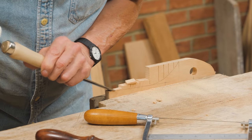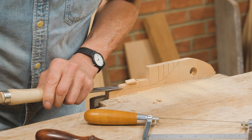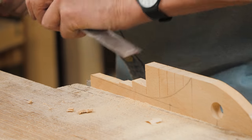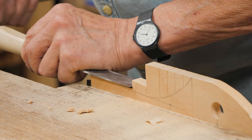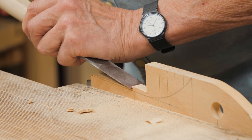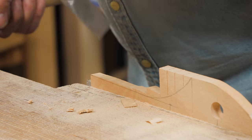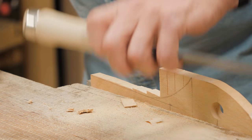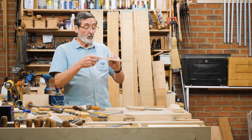And now, I start to follow the line a little bit closer, come up the cut like this, and then work down. Up the cut and work down, because the grain can change direction, like that one nosedive just a little bit, so I'm going more cautiously, come up here high up, split cut that wood out of the way. Now can you see that step? That's because the grain is nosediving, it's going down when I don't really want it to.